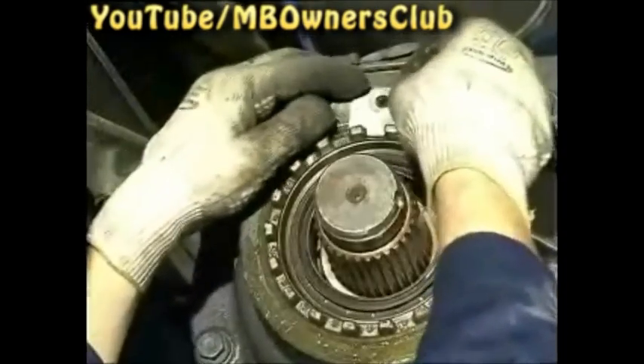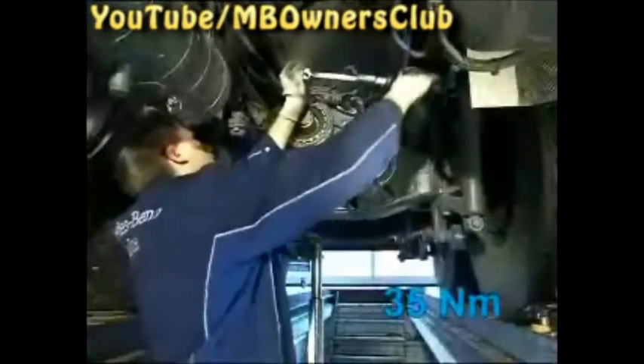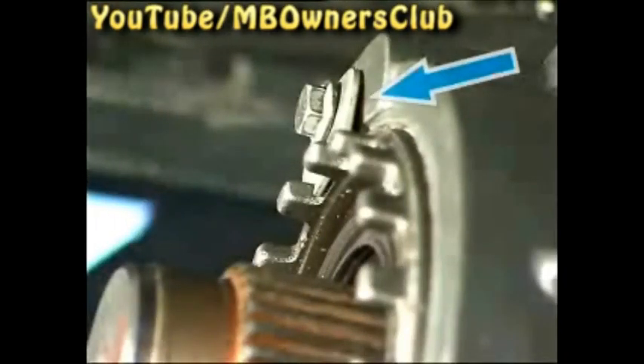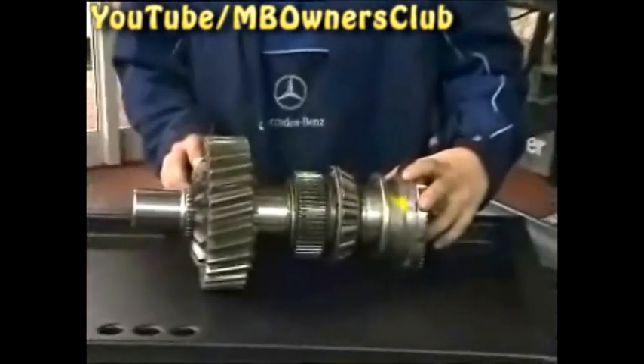You have four possibilities of how to install the locking plate. Tighten the screws with a torque of 35 Nm. If the locking plate doesn't fit flush, that means the plates of the input shaft are not in their prescribed position. In this case, you must remove the threaded ring, including the frame cover, and make sure that the plates fit correctly. We show you with this model.